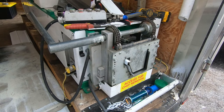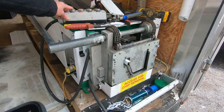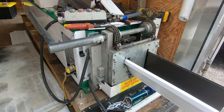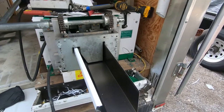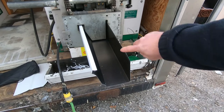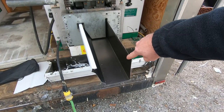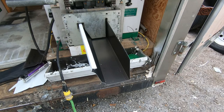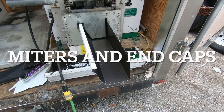It's time to make some gutter. The machine's in forward, meaning the gutter is going to come out, and then I'm going to show you the different cuts we make on it, the end caps, and all the other things we do to get it all ready for your home. I'm going to press the button now — watch as it comes out, it's as simple as that. This is a K-style gutter machine, by the way. You can see that back lip I was just telling you about earlier — the final rollers make sure that comes out perfect.